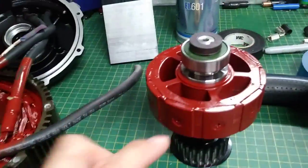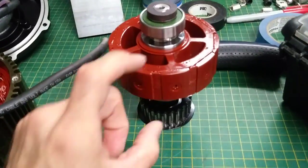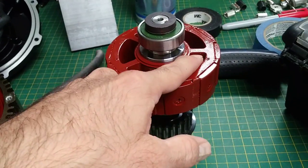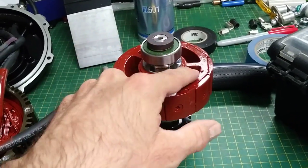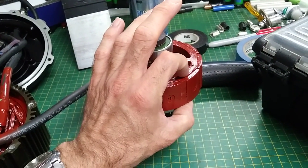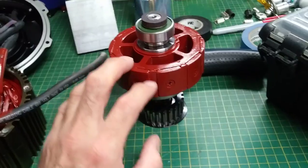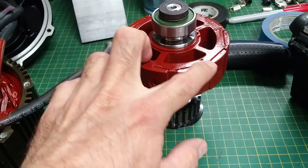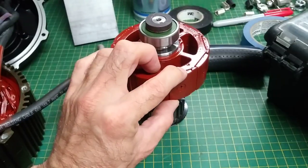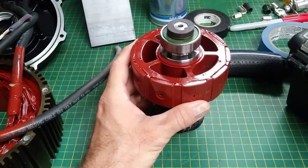The second reason why it's important to have varnish on the motor: when there's moisture presence and temperature variation, the rotor is made of laminations — small sheets of iron. When there's rust on these, they inflate just a little bit, and the accumulation of all these laminations creates a small variation. The rust going inside causes the glued magnets to unstick because of this change in width. There are three ways to hold the magnet: the screw, the trapezoidal shape, and the glue. The glue is the most important, and you don't want it to break because it will break the magnet.